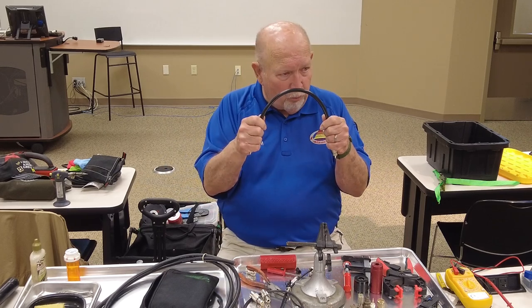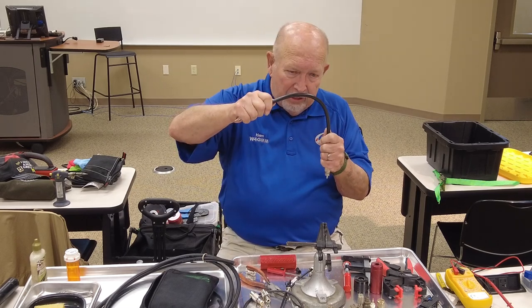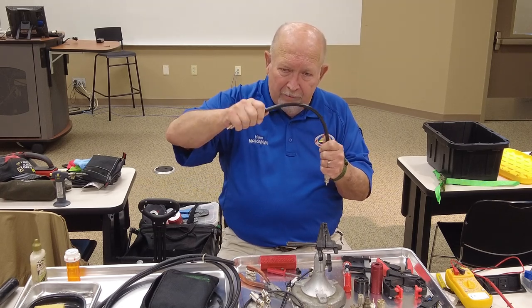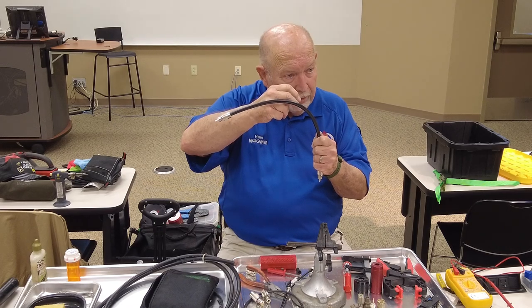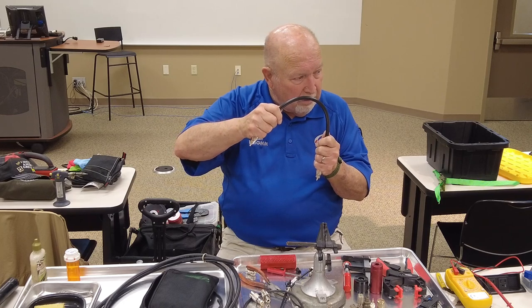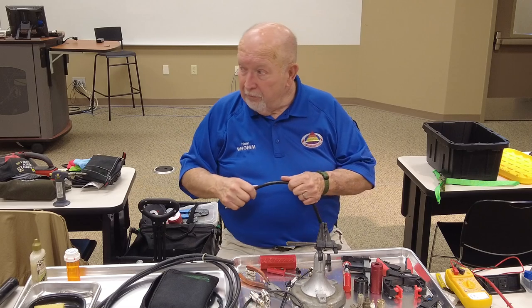And that's a bad thing with foam too. If the sun gets it hot, and you're transmitting on it, and it gets hot, pretty soon that center conductor is going to migrate through that foam, and all of a sudden you got a short. Or you got a capacitance problem, and you're wondering what in the world do I do? It'll change your impedance too.